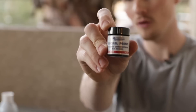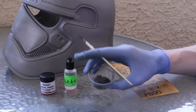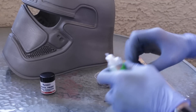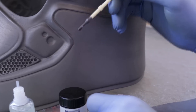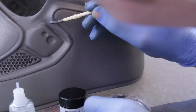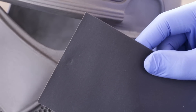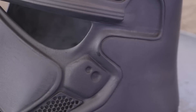The best product for this fix is also made by MG Chemicals and it's called Nickel Print. You can just paint it on with a paintbrush. We have the nickel print, a mixing bowl, and some acetone for thinning things out. We'll add just a few drops, stir it so it's nice and syrupy, and slowly paint over the affected areas — you won't even be able to tell we screwed up. Once the paint dries, we'll carefully sand down the affected areas with 800 grit sandpaper.